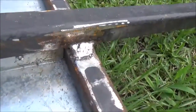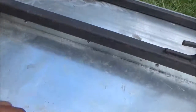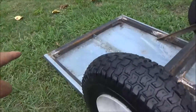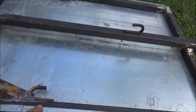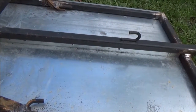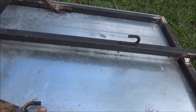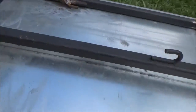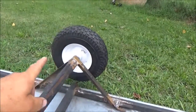See right there, the big old gobstopper. Anyway, I made the frame out of tube steel, went all the way around with it, welded it in the corners. This sheet steel is something I had — I told you I got it as packing from a commercial air conditioner that somebody had gotten. I made it and wrapped it around the frame.